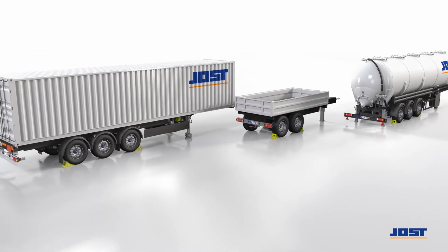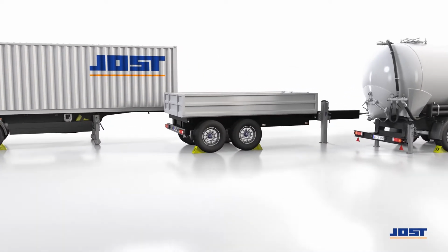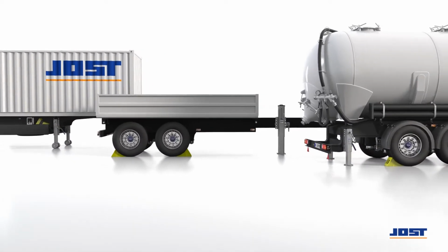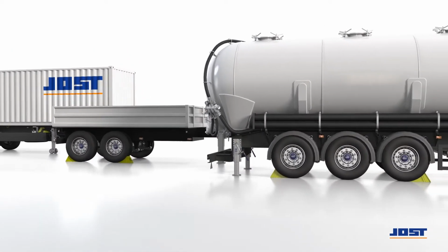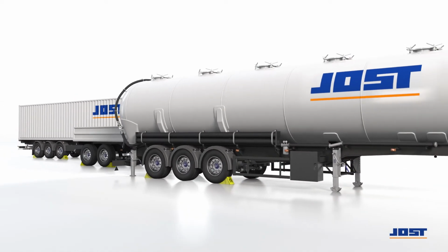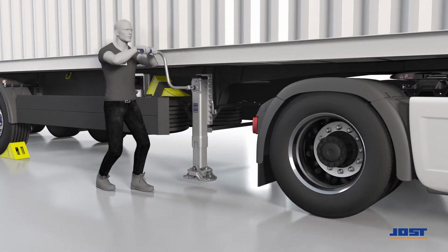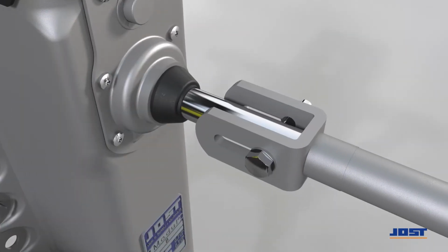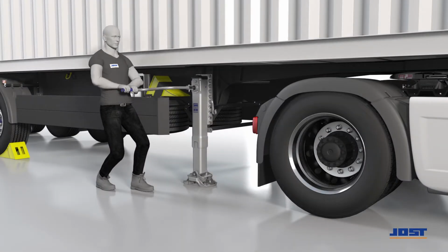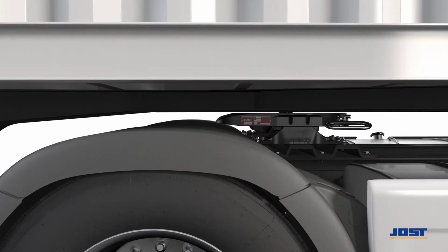JOST Landing Gear is extremely versatile and has been tried and tested in daily applications. The flexible, modular design of the module range caters to almost all customer requirements. The coupling of two landing gear legs via a connection shaft ensures the trailer's even raising and lowering. The internal gearbox requires only minimum crank forces, both in high and low gear.